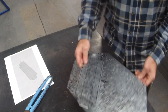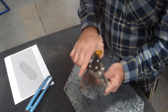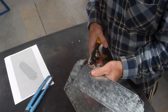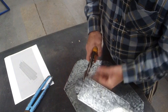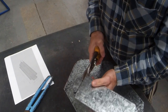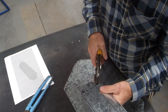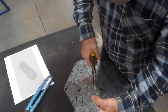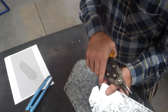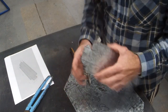That's it. You guys can rock out. So, we've taken the corners off. Please check you're cutting out the right bits. My hot tip using these guys as well, any of the tin snips, is have the end of it lined up exactly where you want to stop, the exact corner. Just treat them like big heavy duty scissors and snip the little sharp bit off. It's super important in both parts, they get really nice sharp corners.